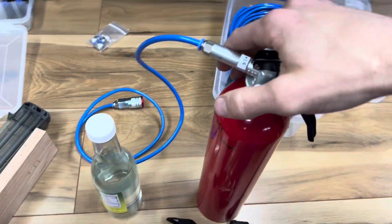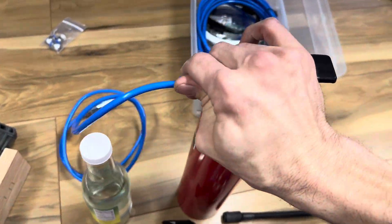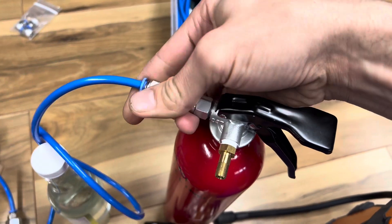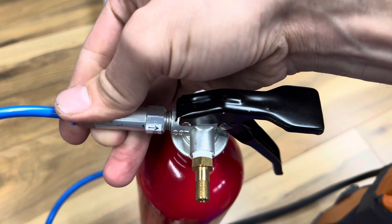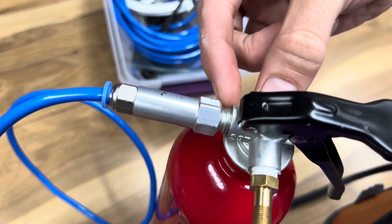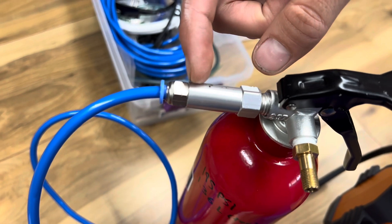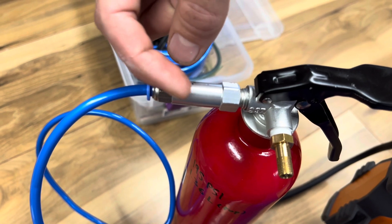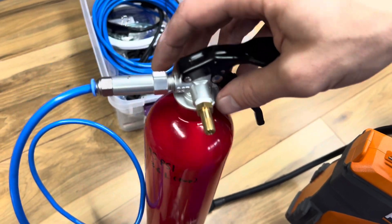I think I explained everything it takes to build. The front is the most annoying part — this interface is not meant to retain pressure. So instead of putting a fitting on this front part, I just kept this front nozzle and tapped it. I used a quarter-inch NPT tap on this aluminum — very easy, it's a soft metal. Clear out the threads; don't let metal debris get in your bottle while you're building it.